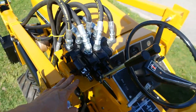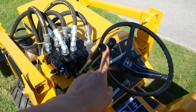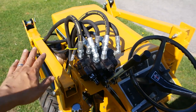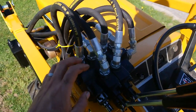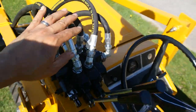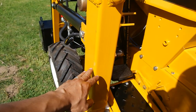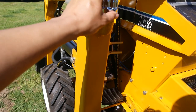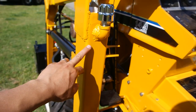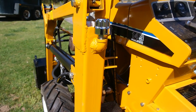Here's the two-spool hydraulic valve. This outer handle operates the tilt and curl of the bucket on the front end loader. The inside one operates the boom — the up and down. There's also a float position, so if I push this all the way forward, the front end loader will float with the contour of the ground. All these hoses and fittings I got at surpluscenter.com. This is called a Power Beyond port right here — this is what supplies oil to the backhoe. This left upright for the front end loader acts as my oil reservoir, with a breather cap that has a little air filter inside so air pressure can go in but dust and debris are kept out. This whole hydraulic system took about five gallons to fill all the cylinders and the reservoir.